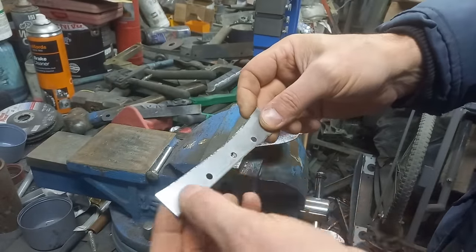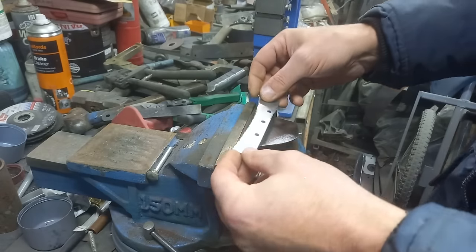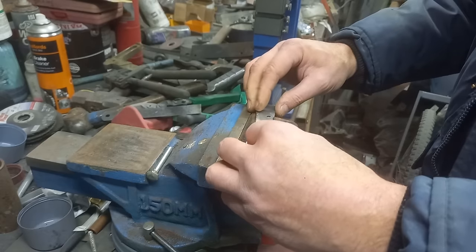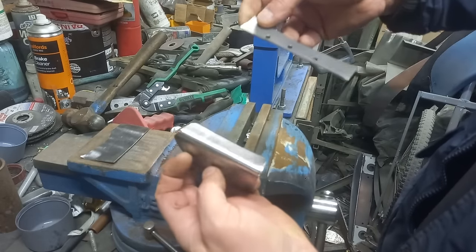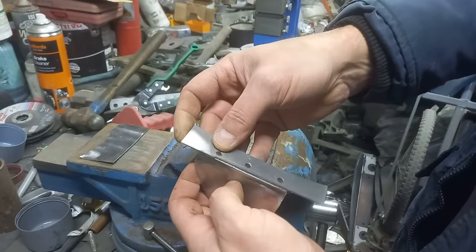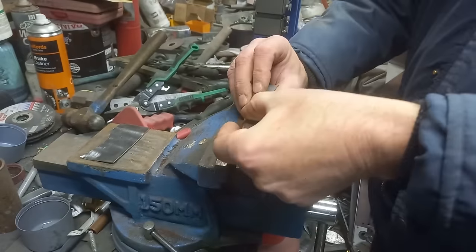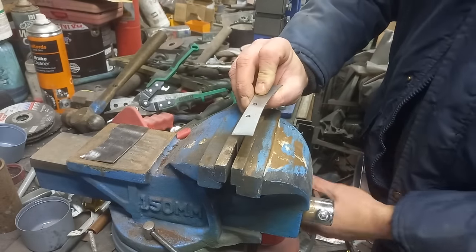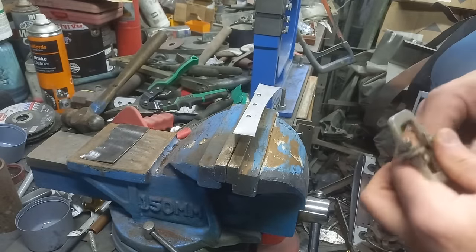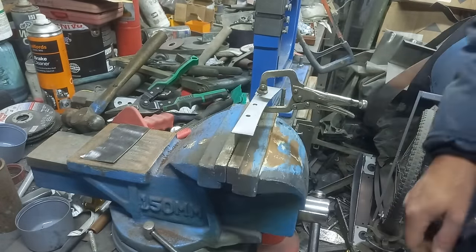And these can be any sort of size. It could be up to 8mm if you're drilling out an existing one and reusing. But this would be perfect for showing how this works. Two flanges and your bit's been spotted out, and that's where they'll plug weld together. So if we get these under here, see if I can get a nice tight shot of what's going on. Now you want these to be nice and tight to each other, so lots of clamps usually in order.